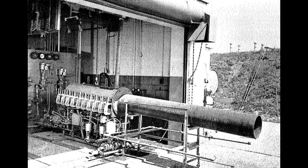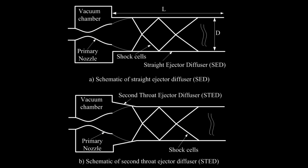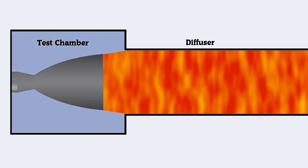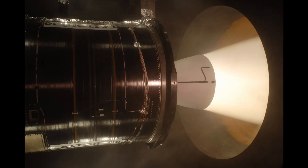What you'll typically do is place a cylindrical section — a long tunnel referred to as a diffuser — after the rocket engine's nozzle. This uses fluid mechanics similar to the Venturi effect, though not technically the same thing. You set it up so that shock waves coming off the lip of the nozzle impinge on the wall of the vacuum tube and bounce down the tube. That makes it very hard for molecules to flow in one direction but very easy to flow in the other. So the rocket engine is blowing all the gas down the diffuser, and any gas in the test chamber near the engine gets sucked down and exhausted out. You can literally have a closed chamber with a diffuser, the engine inside, and once that engine lights it will suck all the gas out — you're then firing in vacuum conditions.